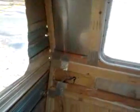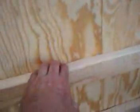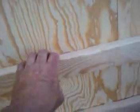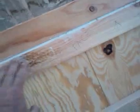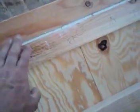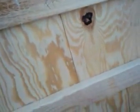And that's pretty much all I've been doing. It's a lot of work, you know. I had to put all these wires behind the wood, and that's tedious, time consuming work. The lower panels in there, you had to rip all these down a quarter inch by their width and length, so that it was the same thickness as this here. And then I just bonded the two together with this adhesive caulking.